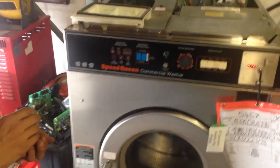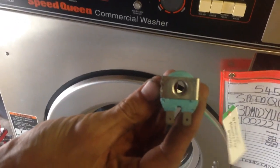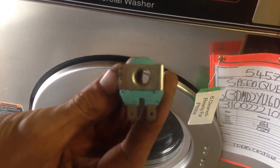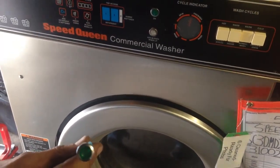The first thing you're going to want to do is check the valves themselves. The voltage is stamped right on the top of them. You want to make sure that the lights you're using are the same voltage as the valve. These particular valves are 110 volt, and I'm using the same 110 volt light that's the on light for this machine.